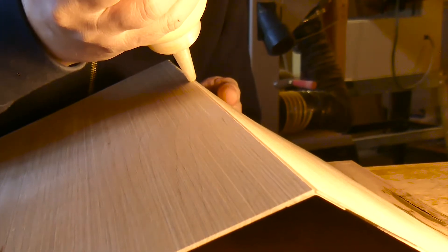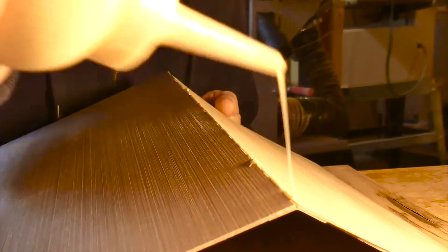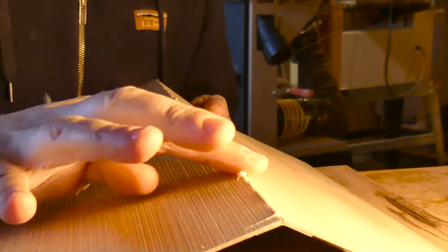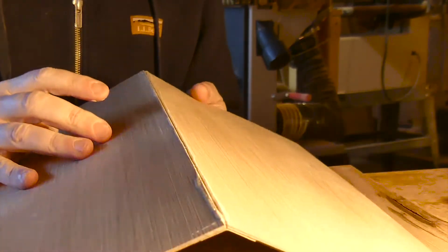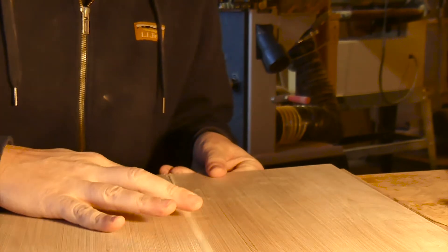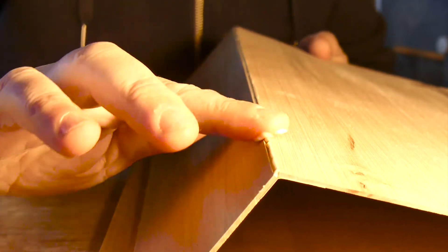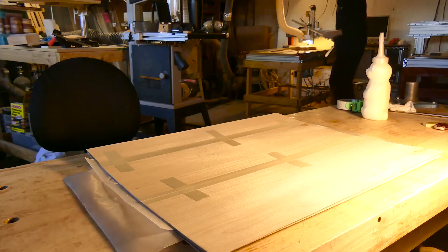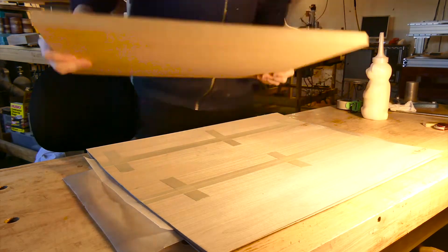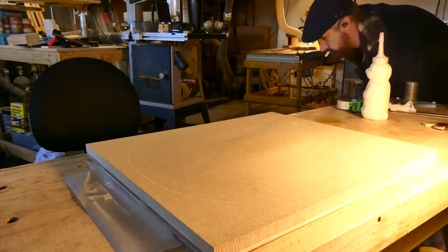Most commercial veneer press tops use alternating 90-degree laminations. I don't. I prefer to make these as close to a carve top as possible, and to me, this method works great. The center block and sides will resist any creep or tendency for the form to lose shape over time. This is not the most consistent method, and while I usually do get a decent shape, at times the natural tendency of the timber to cup and bow with the moisture in the adhesive causes inaccuracies. More reliable results might be had with the use of epoxy instead of wood glue, and I have plans to test that.